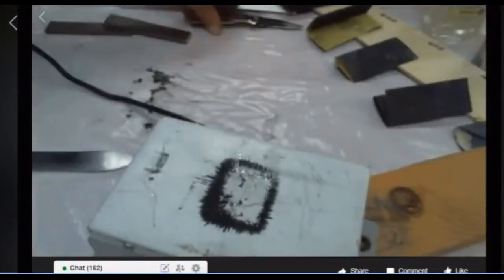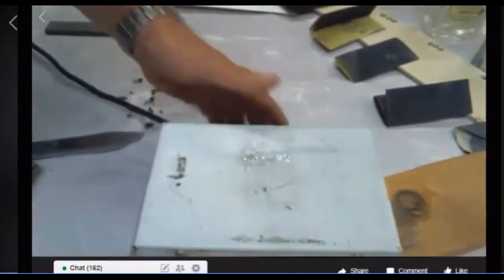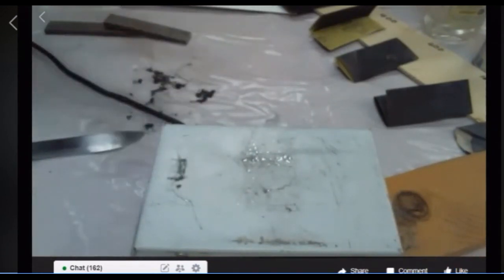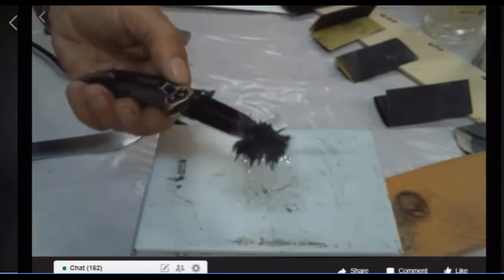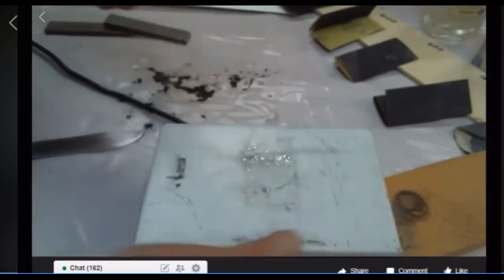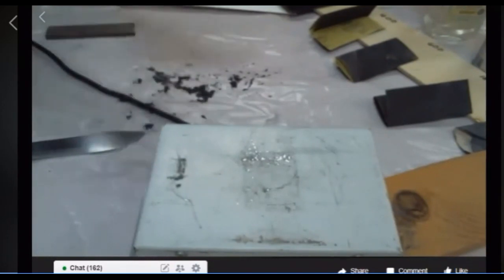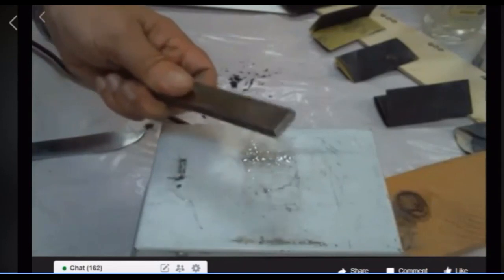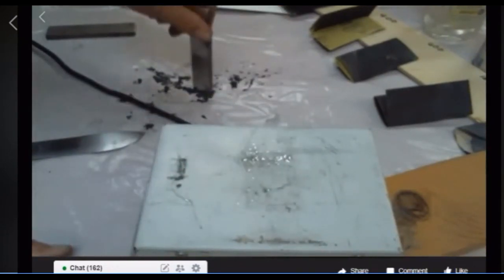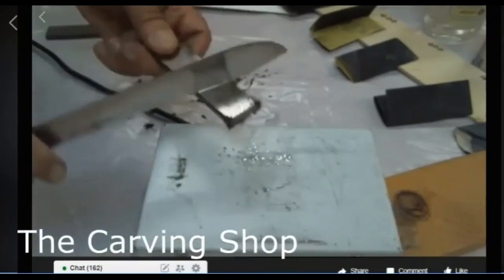You can also test steel for hardness using this. Let me clean off this fuzz and take this knife here — I'll magnetize it and see if it's a hardened steel. There it is — it's hardened steel, so it holds the magnetism very well. Now I'll demagnetize it by lifting it up while it's running, and it doesn't pick anything up. Here's a piece of steel that is not very hard — now it should be magnetized, but it picks up very little, so you can see there's almost no hardness and it gives up the magnetism pretty quickly.